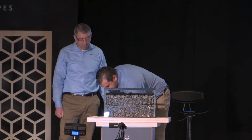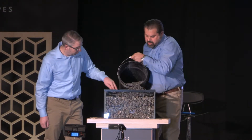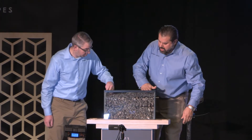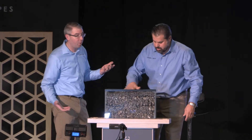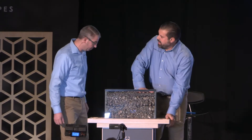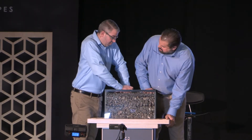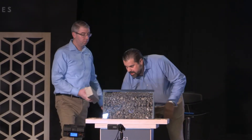Our bedding layer is going to be number 8s — this is a crushed stone, not recycled material, a three-eighths inch chip. We're using one inch, even though the industry says two inches. Why? We have one-inch screed rails in our trailer, so there's no need to buy new ones. And since we're putting that layer of fabric in, we won't get any choke at all. A little bearing ability check — tiny, tiny bit of movement, just rearranging particles. What we're doing with our hands is basically a deflectometer test.